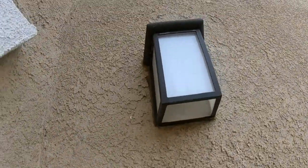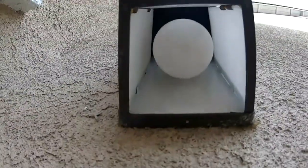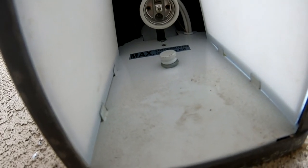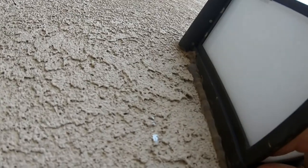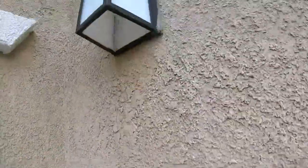This is the light that's going to be replaced. Let's see how this comes off. I see there's silicone sealant around the edges to keep water away from the wires. There's got to be a screw affixing it against the wall — it has to be behind the bulb. There's a single nut holding this to the wall. I'm going to unscrew this, making sure the light switch power is off and I'm not touching anything that could hold an electrical charge. It's still stuck to the wall from the silicone. Cutting the silicone with an X-Acto knife should free this up.